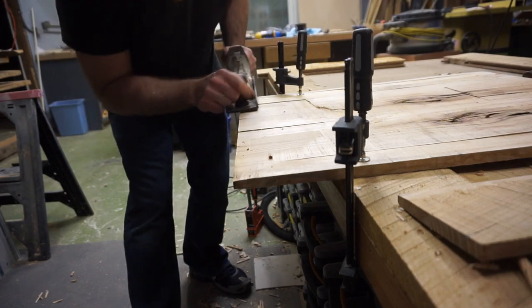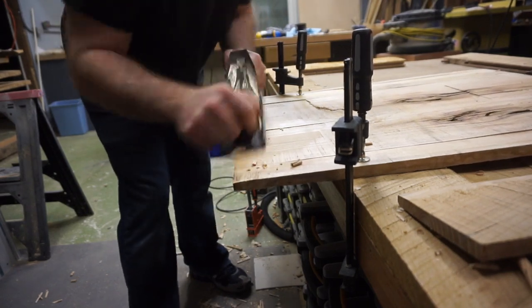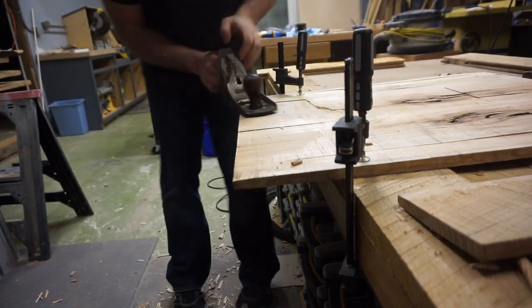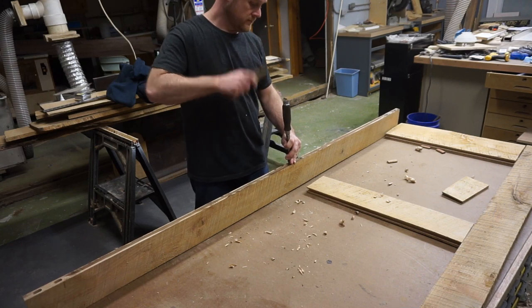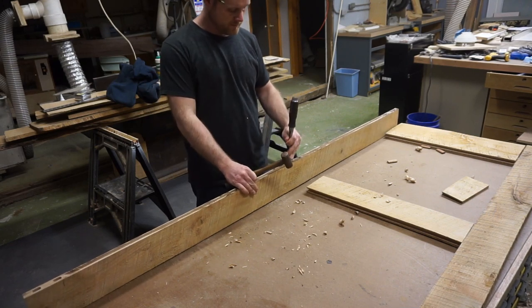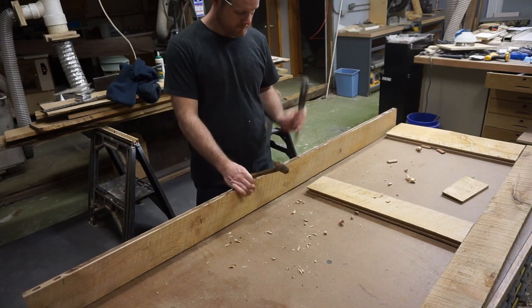Because I've got a half inch groove, and even if all the boards are half inch, if they're not lined up as a panel, they may be wider than a half inch total. Where I made the dados in the stiles and rails, the roundness of the blade makes the dado a little shallower right at the corner where the rails meet the stile. So I had to take my mortising chisel and chisel those out nice and square.